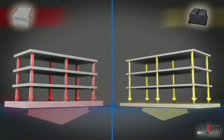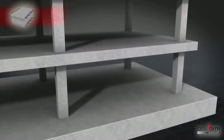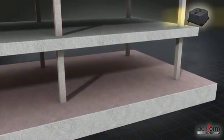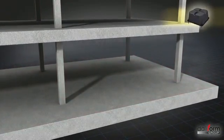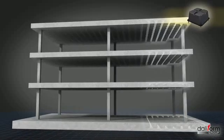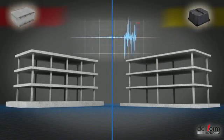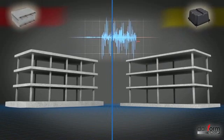Compared with a full slab, the weight saving will favorably influence the dimensioning of pillars and foundations, allowing thicknesses to be reduced in both cases. The foundations will be less important and less stressed. Also, behavior under a seismic profile will greatly benefit.